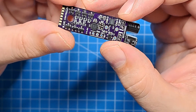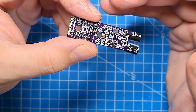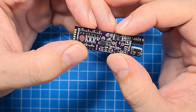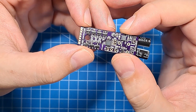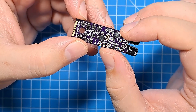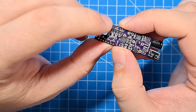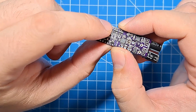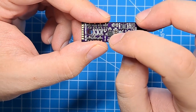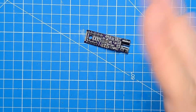And there is a finished blade controller ready to be installed. Before I install this one I'm going to test it — I have a jig that lets me test these things. You probably won't have that test jig and you're not going to know if it's going to work until you install it in your blade, but chances are, as long as you've got all those pins as individual pins on your microcontroller and all the dots on your voltage regulator and your microcontroller line up, and as long as you've got the PNP transistors in the right place and the N-channel MOSFETs in the right place and haven't swapped them — which I have done by accident once — you are pretty good to assume that it's going to work. Make sure your programming is done as well, which we did in the first video.